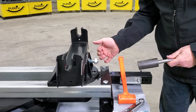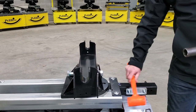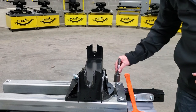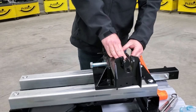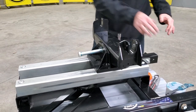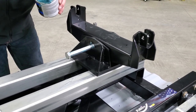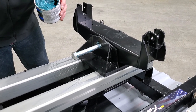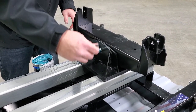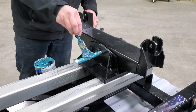Don't pull it off all the way — just pull it to where it's hanging off a little bit of that bolt so we can hit it without damaging the threads. Now we'll pull it off the rest of the way. You can pretty much push that bolt out until you can start seeing some threads. Just your run-of-the-mill bearing grease here — it's a lot less messy with a paintbrush. Just going to coat the shoulder of the bolt. This isn't something that needs done all the time — just annually.